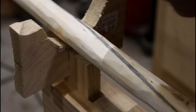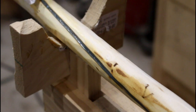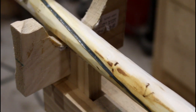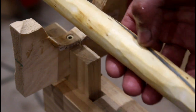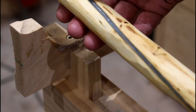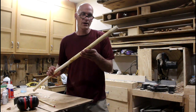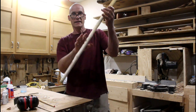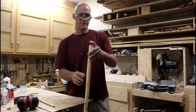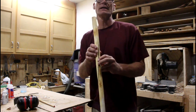I'm just going to put some mineral oil on because that will take out the dust and you can see what it's going to look like. That's what it looks like right now. I would normally sand that to a higher grit so that it's even shinier, but it looks pretty good just as it is. Just a quick video to show you how I go about doing that — it's a nice cane, and you can carve a topper for it to make a nice little cane for somebody with an epoxy inlay. Thanks for watching, I appreciate the support.